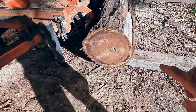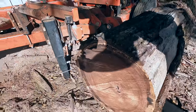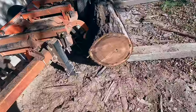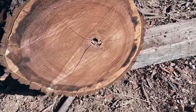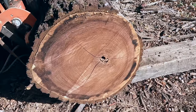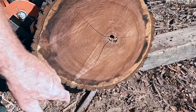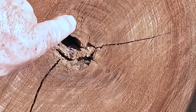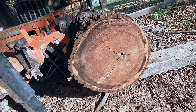So today we have another not-so-good walnut. It's got some bug stain right here on the sapwood. It's not a real problem because I don't much like sapwood, but it's got a characteristic walnut Y-crack — basically meaning there's stress running in every plane: that way, that way, and that way. And of course we have a nice hole right in the middle. You can see where this one's rotted out — all kinds of shake and whatnot.